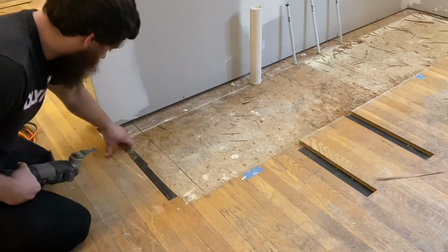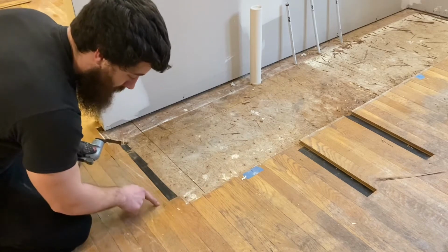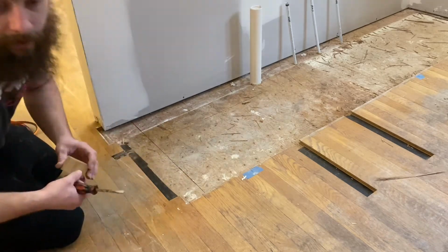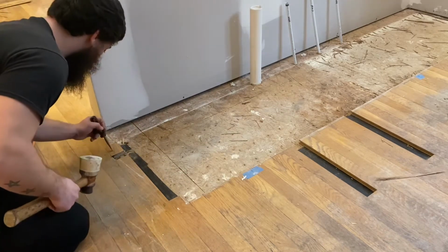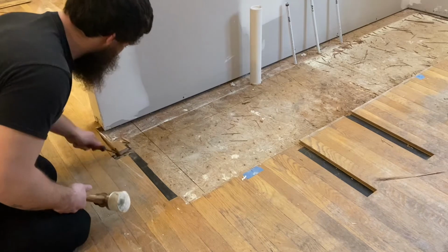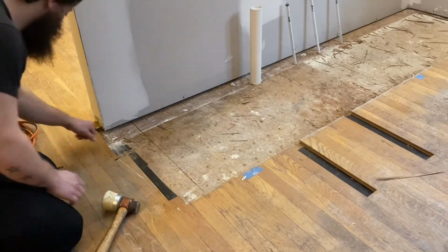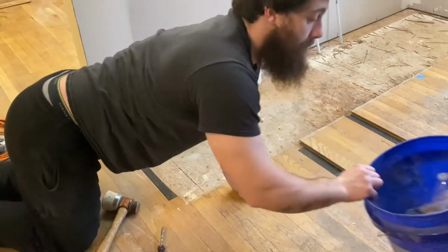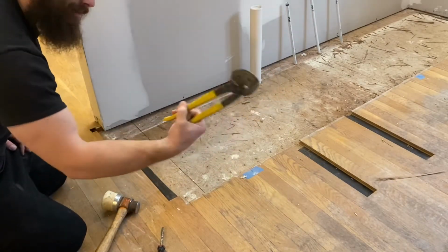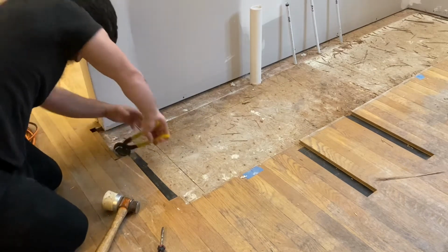This way, because I am not touching this board or this board at all. So when I cut through this one, I never touch that board. Slid it out that easy. There's a nail here, it was top nailed. I like to split it there. No longer need a claw hammer either. These bad boys right here, extractors. You grab a hold of anything.